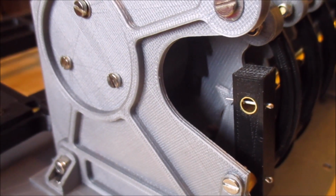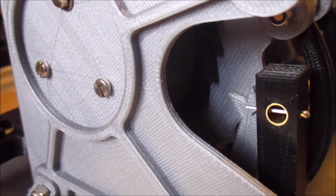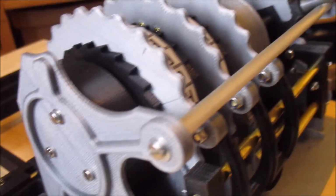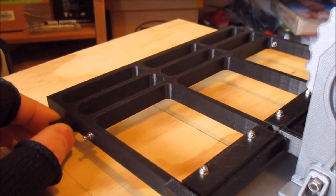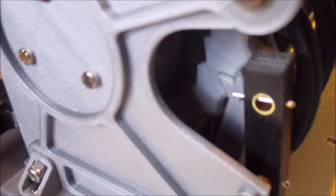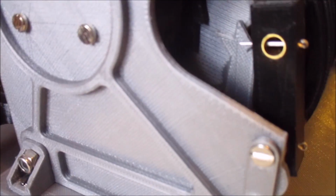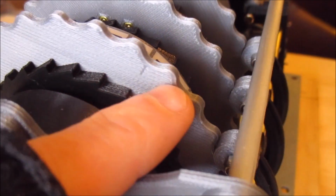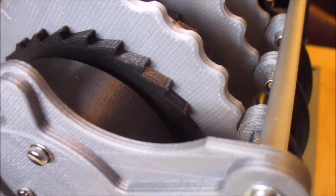Okay, we'll see if we can get some close-up looks at how the pawls actually make the rotors move. So this is the fast wheel here. This is the rightmost one. And you can see as you press down on the keyboard part, it causes the pawls to lift off their little bases, and so come in to engage the rotor. And of course the rotor is held in a particular position by the little wheel here. So you can see that holds it in a fixed position.